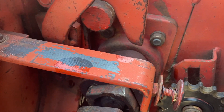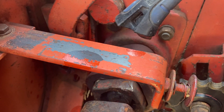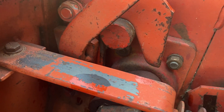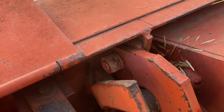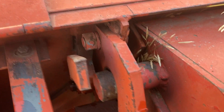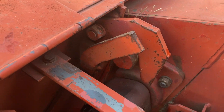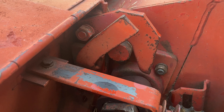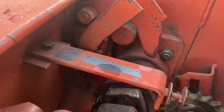When you're hooking up, you try and line these circular pins up with the hooks on the header, and you've got just a little bit of room. Everything needs to be straight, level, and flat to hook up. Once you hook up the top, you can lift it up and then do the rest.